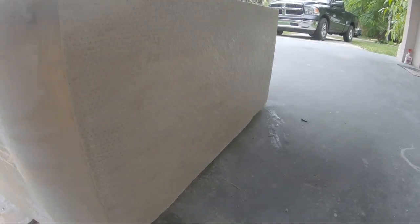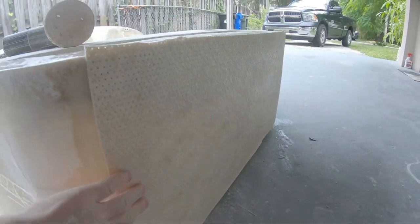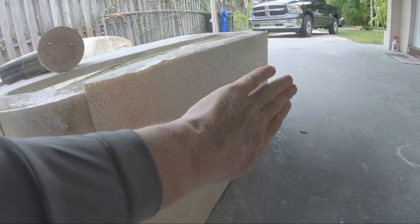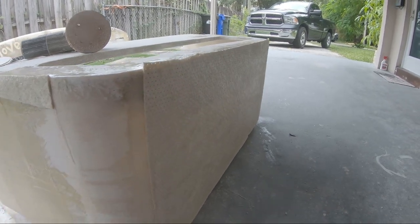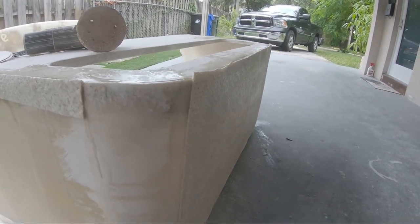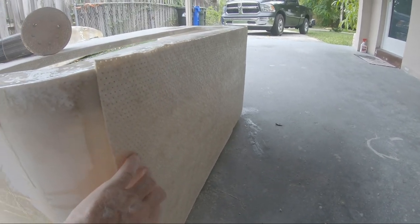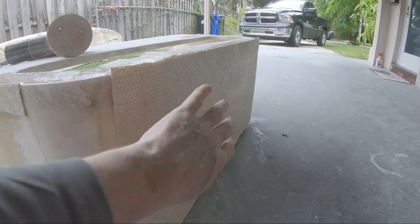This is a layer of core mat saturated in resin, and I put that all the way across the front because I have a little dip in the center. I'm hoping the thickness of this will solve that dip — it's very slight — and when I sand it down and do a light skim coat of fairing compound it'll be a lot easier to make it consistently smooth.